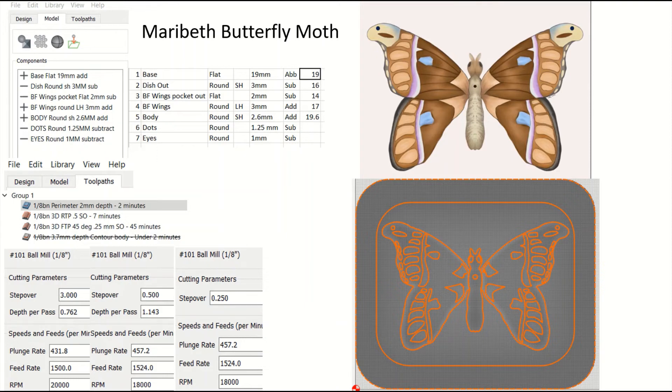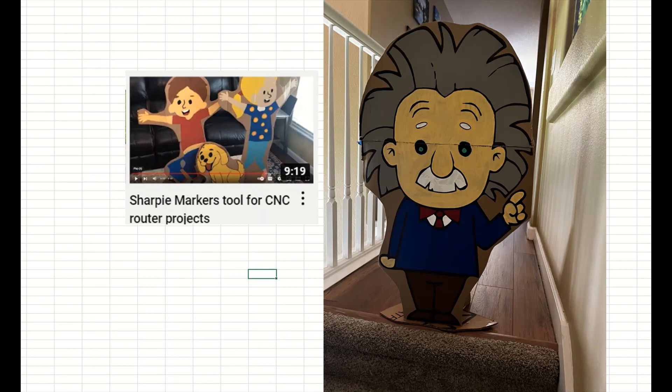The seven pieces are covered in video two and shown again at the end. For the tool paths, I'm using an eighth-inch ball nose for the perimeter cut, then a rough tool pass, a fine tool path, and an optional additional one. These settings are how I had them set up for the perimeter, rough pass, and final pass. The numbers shown are based on pine, which is a soft wood, so adjust for your own material.